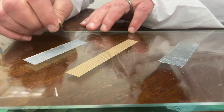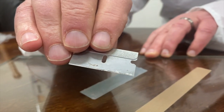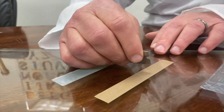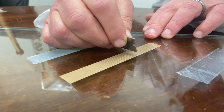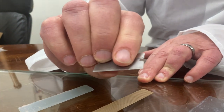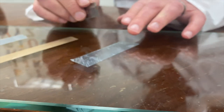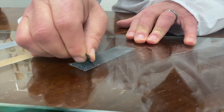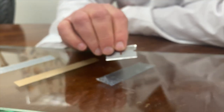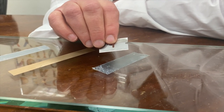So I'm going to demonstrate using this razor blade. I'm scraping the solid PTFE and you can see very quickly it builds up residue as it's being scraped away. Now we'll do the same thing to the fiberglass cloth with the PTFE on it — it doesn't come up quite as quickly, but it will wear out over time. Last but not least, we have the UHMW. I'm scraping it and there's virtually no residue. The UHMW is 10,000 times as abrasion resistant as the PTFE tapes.